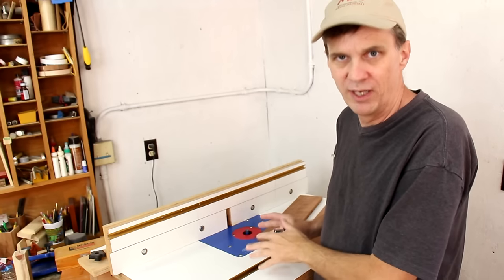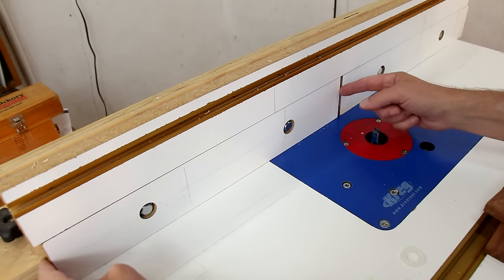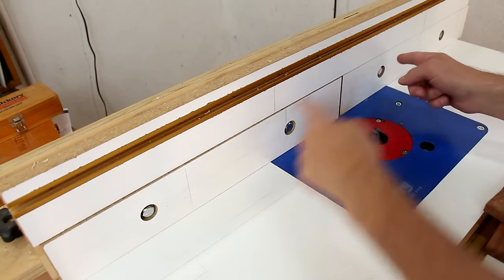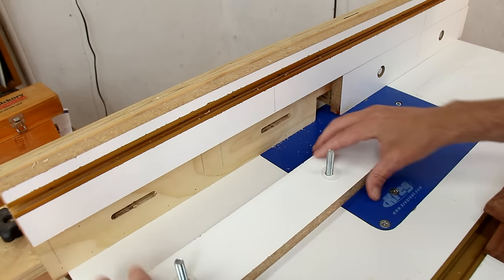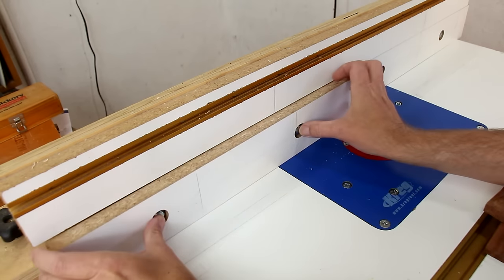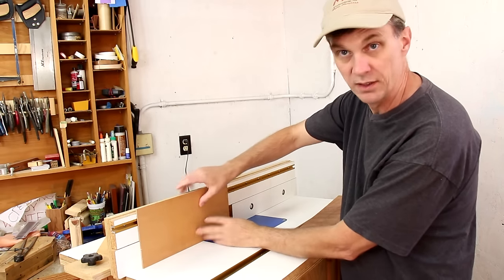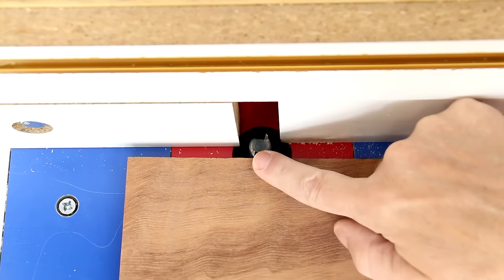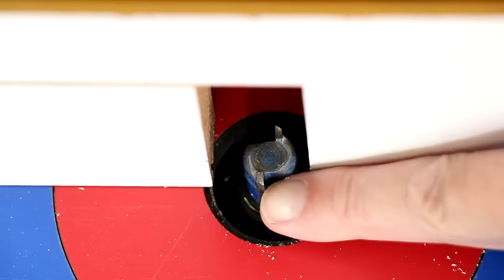Even though I've shown this in other videos, I thought it would be nice to have a mini specifically about this procedure. The only trick here is that you need the left side of your fence to stick out slightly ahead of your right side. I have a split fence system on mine that I can remove and just put in a couple of washers as spacers to shim it up. If you don't have a split fence, you can just clamp on a thin strip of plywood to the left side. I've put a straight bit into my router and raised it up slightly above the thickness of the wood. Now I can bring my fence forward to where the left fence is in line with the cutting blade, and I'll just use a straight edge to check it.